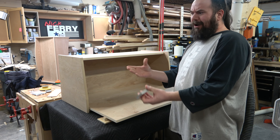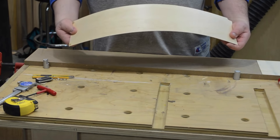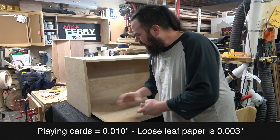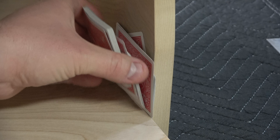The neat thing is you could go around your shop and plane a little thin piece of wood, or put it through the drum sander if you have one and try to find that exact thickness. But you don't need to — I believe playing cards are about three thousandths of an inch a piece. So you just kind of let them fall into that crack, see how many they fill up, and jam them in there.